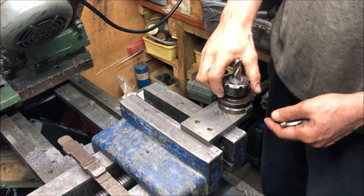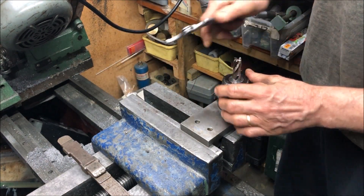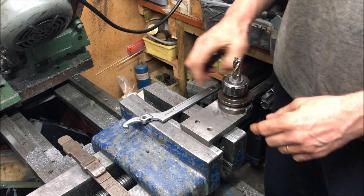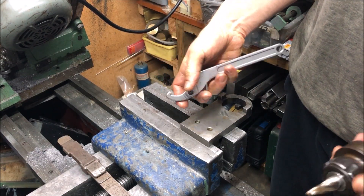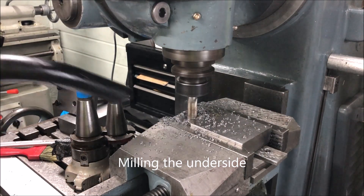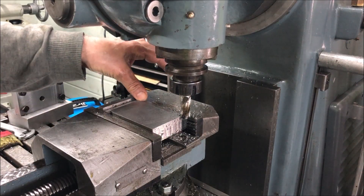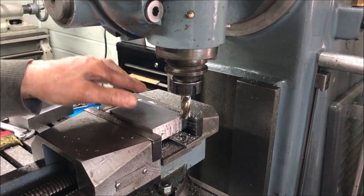I usually do it as I showed on the mill. But if I have a collet holder with a 16mm end mill, I use this tool because I can get a more firm grip. This is just a spanner I bought — NTN, the bearing company — so I thought that was okay instead of having just fixed spanners. In this case, I just continue with the end mill here. Although it takes longer, it's at least at the same height with no problems. I also like to lock down the in-and-out travel and use the longitudinal feed.